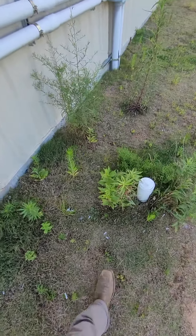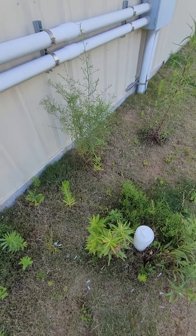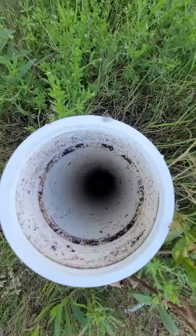Here's a video of what's going on here. They say they got no bathrooms, can't flush toilets, no water — that's not the case right now. Right now the line is clear because they haven't been using it. The clean-out's clear and flowing water from the toilets and the faucets in there.